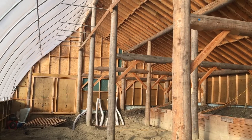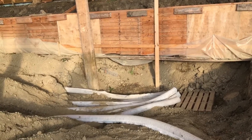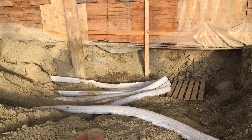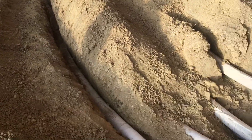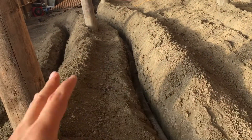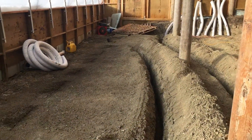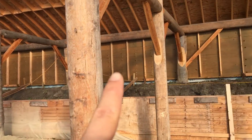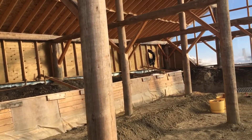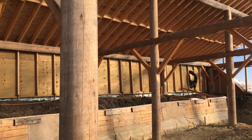This greenhouse will have an annualized geosolar battery. There'll be a large ductwork intake along the top that comes to a central point, filtered down to two large IBC totes — those thousand-liter totes — and they'll act as the manifolds for distributing the air into these earth tubes. These are buried between two and three feet below the grade here, stacked one on top of the other. The exhaust tube is on the bottom — it takes warm air out all the way along. The intake starts at this end and the air comes all the way in, warmed by the soil mass around it, and heat rises.